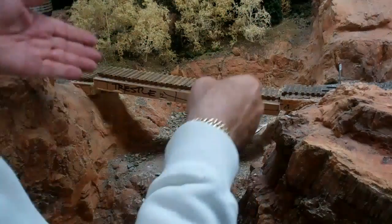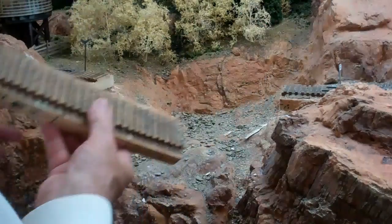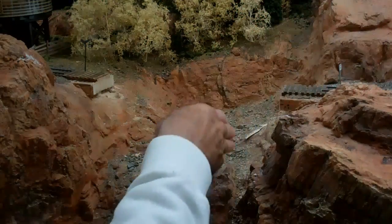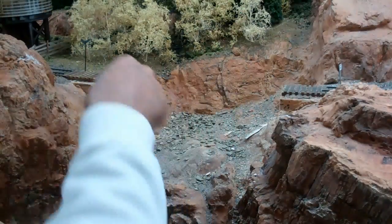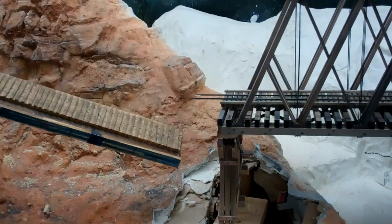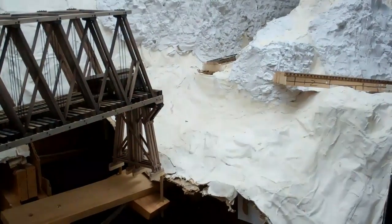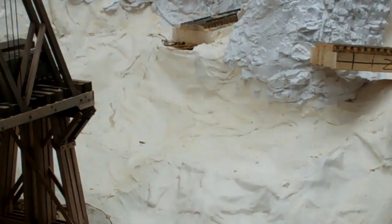We measure the length of the trestle going in, remove the rail, and use a jigsaw to cut through and remove the old section — that becomes the template we'll use. We can now start setting the new trestle in, leveling the ties and securing the footings of the bents for solid support, then reinstall the rail. The same thing has been done at both ends of the through Howe truss bridge — the piece is cut off at the other end as well, ready for the new trestle section.